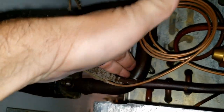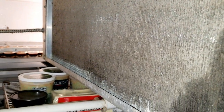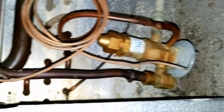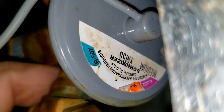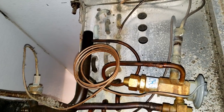Coming down to look — it really looks like that's probably where it's leaking. You can see the oil shining right there. And looking at this coil — there is the refrigerant leak, you can see it's leaking in the coil. Between the dirt and the oil leak, looks like we're running on R404A.